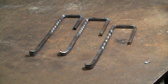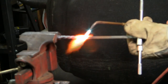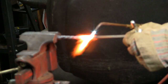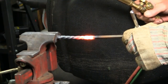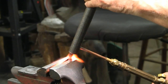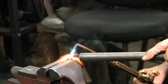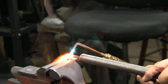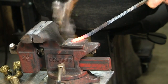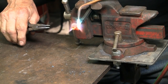These are some kitchen hooks I recently made for hanging my woks. The oxygen acetylene torch is not a substitute for the blacksmith's forge, but for small jobs it's adequate. The torch works well for heating this steel up to be twisted. It's always fun to make something. The torch is excellent when wanting to bend metal, such as this one-quarter inch square. Using the pipe for leverage, heating the steel up to red hot, and the steel is easily curved into the desired shape. This little anvil on the vise is no substitute for the blacksmith's anvil, but again, it is adequate for small jobs. Using an old pair of needle nose pliers, directing the heat exactly where I want it, and forming this hook.